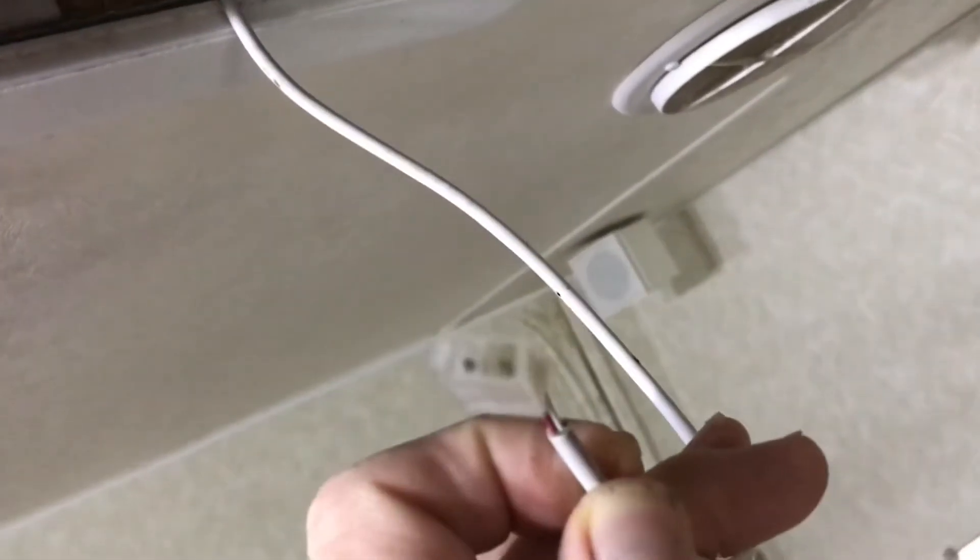It's just a little plug — it's not even a sensor, there's nothing plugged into it. What happens is up inside here, if you put your hand up and over and down where all those wires are stuffed, you'll find there's a drip tray under there. It's probably full of water — either you've got high humidity or a lot of rain. That drip tray is meant to catch water and drain it out, but all these wires are laying in that water, and this plug in particular, if it gets wet, it tells your thermostat that it's 32 degrees inside.